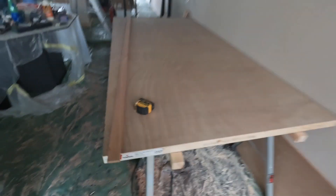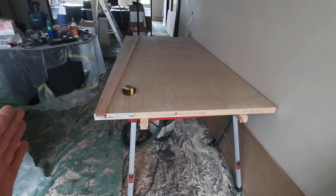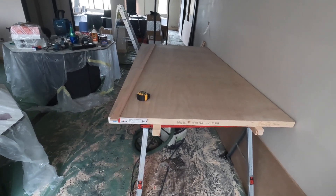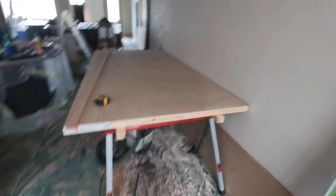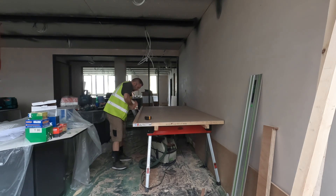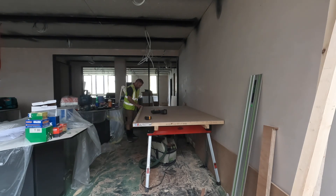We're going to use 12mm thick hardwood lipping. What we're going to do is put the lipping on one side as it is, and then just turn it around and see what we need to cut. The first thing we have to do is take one of the hardwood lippings and stick it on one side. We do this before we even take any measurements from the frame. We put the glue on the lipping, spread it, and make sure you have plenty of glue.